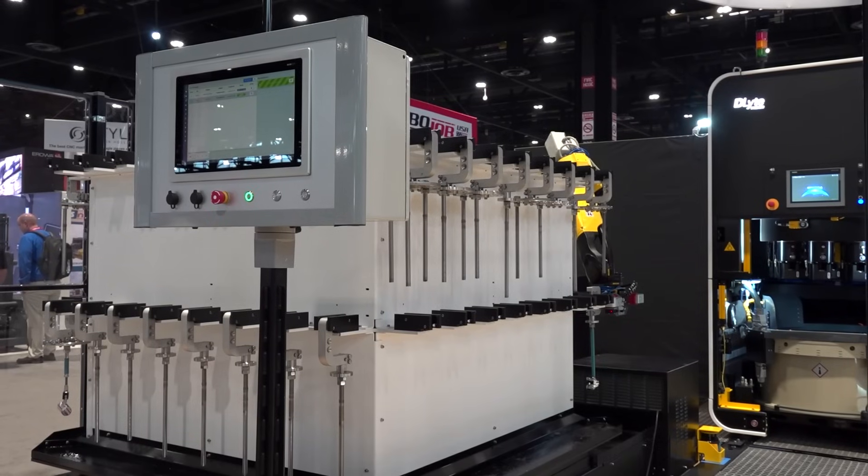We're seeing some massive machinery here — we've got some robotic components, a little bit different from the machine just on the other end of the booth. When we took our technology from a single unit with a single holder, we stepped that up to a system that can run actually eight holders at a time — essentially getting eight to ten times the amount of parts through at a time. Then we added a whole robotic loading system where we can actually load 64 fixtures on our unit here and let the robot do all the loading and unloading.